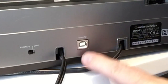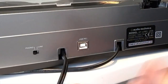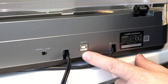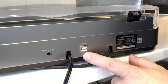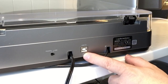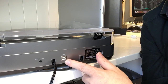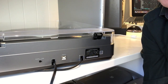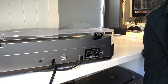You'll also notice some turntables have a USB connector on the back that's designed to connect to your computer. I don't recommend you use this because normally they have consumer-level AD converters inside, which are considerably weaker than what you'll have in a professional audio interface. In this one, for example, it's only a 16-bit converter, whereas my audio interface has 24-bit converters. So we'll get a much better dynamic range using our professional audio interface.